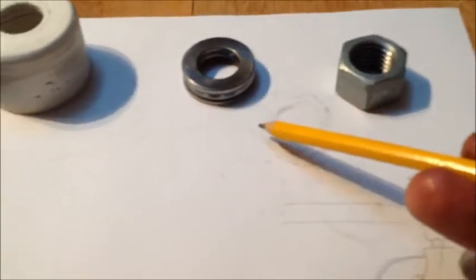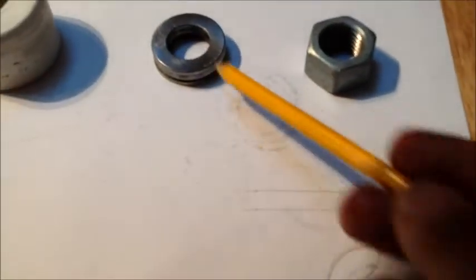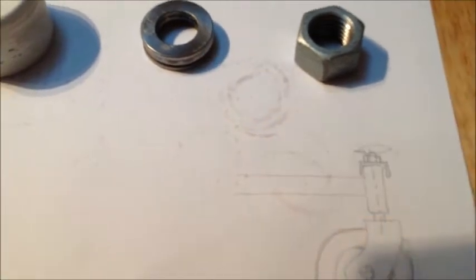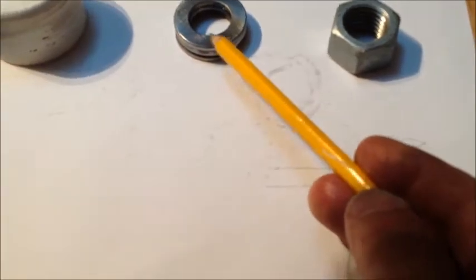The two bearings — here's the other one on the end of the bolt — have to be inserted into the pipe, so that the lower part of the bearing stays fixed to the internal pipe, and the upper part of the bearing rotates with the bolt when you tighten it.